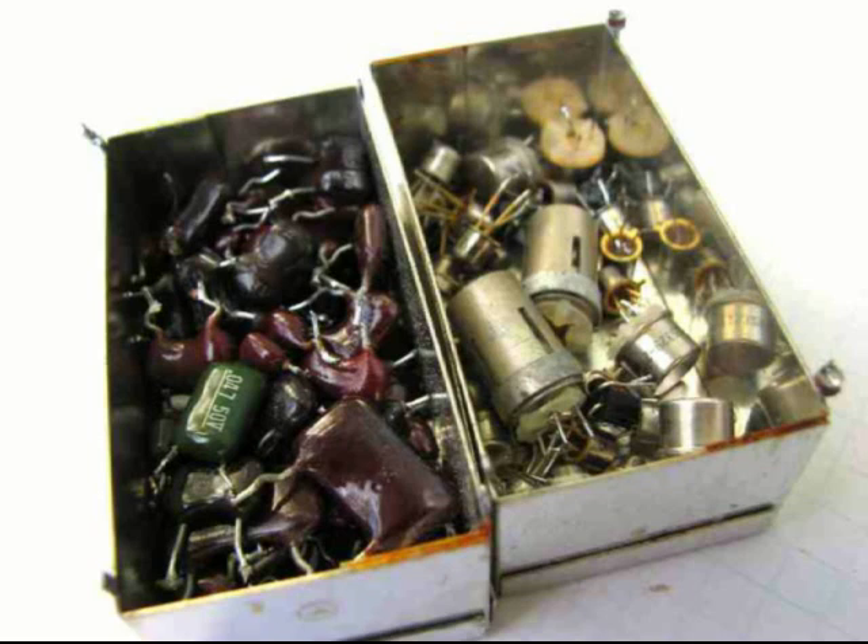There were a lot of silver mica caps in the carcass pieces, along with some notable RF devices. There were plenty of TO39s and some TO72s, all coming out of the higher frequency RF sections. So even if I don't know the part numbers, I know that I've got some high-FT devices.